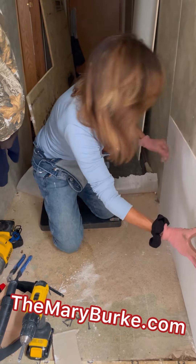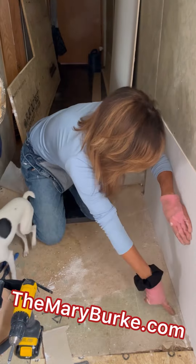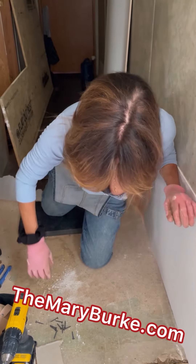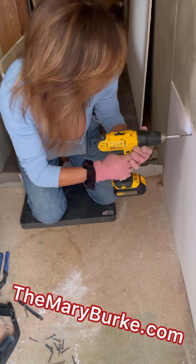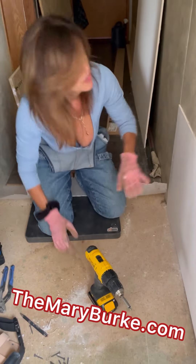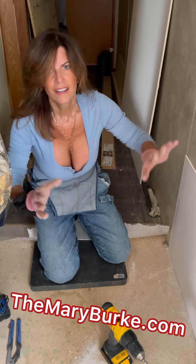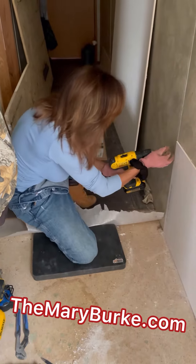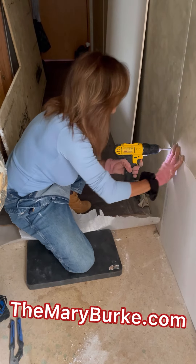Let's bring it in — slide it down. Come on, slide that drywall down, put it into place. And it fits! I know I have a stud here and a stud here — I know it's here at the end, and I have my markings down below. Now we can start on one end. I didn't break the paper but I laid it in flat, so now I've got it all tacked up. I can start working my edges and start screwing away.